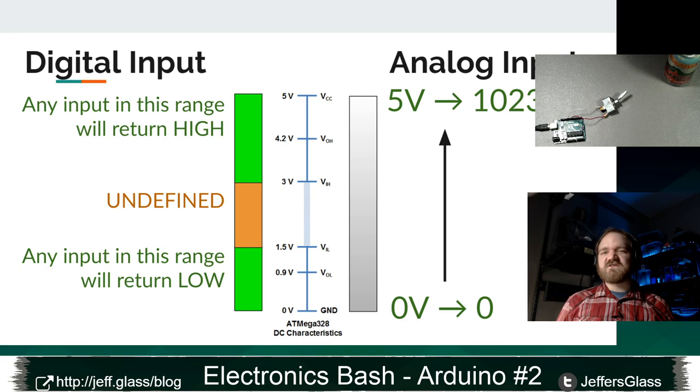And often we're not so much interested in exactly a specific voltage level, although certainly we are. But if you were doing something like creating a voltmeter-like circuit, you probably wouldn't do it directly with the Arduino's analog inputs. There's more specialized and more precise circuitry for that. No, typically what we're interested in is where in the range from 0 to 5 volts we are approximately.